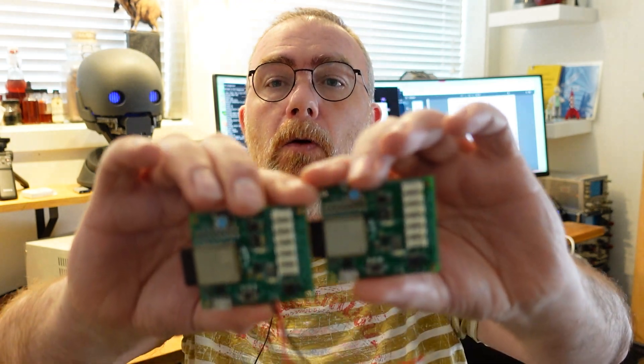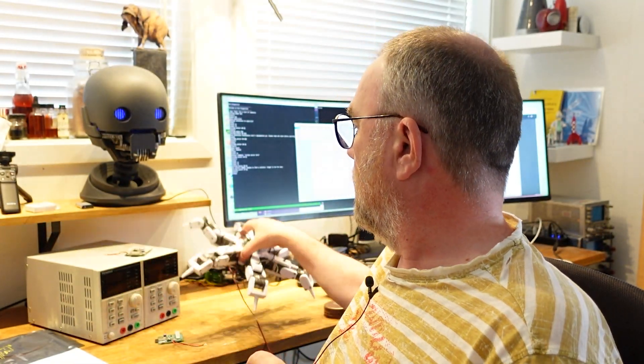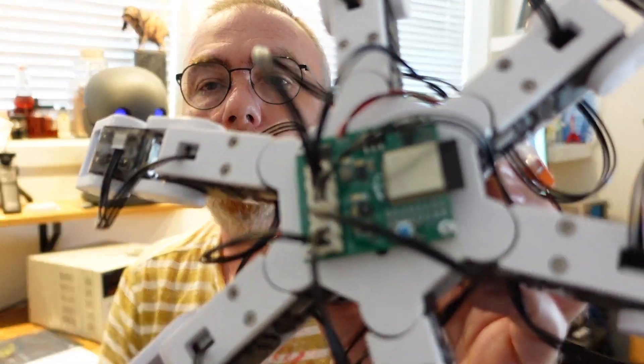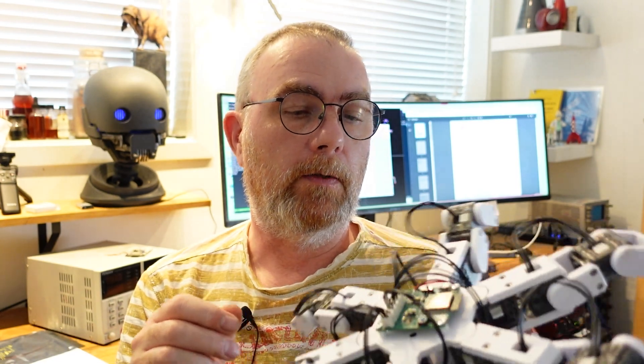So I had to spin a new board. It's almost identical to the old one except for a small resistor ladder where I tap the VBUS from the center point of the ladder, and that works okay. One of the boards is hooked up to my little hexapod — you can see it in the center here. I have six connection points to the servos, and that's just for convenience. I could have gotten away with one, but six makes it easier to detach one leg at a time and do testing.